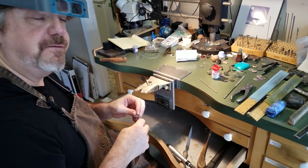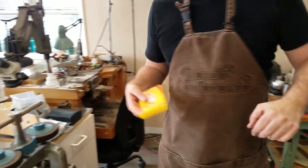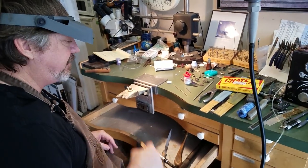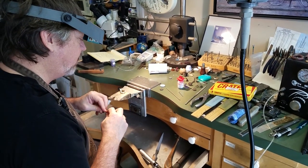We're going to switch to my favorite abrasive, which is Cratex. Yes, Cratex smells bad, but it is the best abrasive I have ever found for working with jewelry — I've been using it forever. We get this from Gesswein. I get these in the smaller round square size, and again this is all about smoothing and blending. The Cratex is quick and it does a fantastic job.